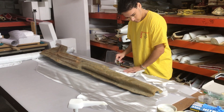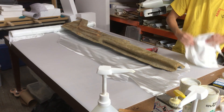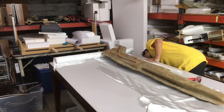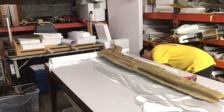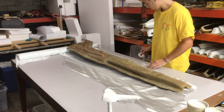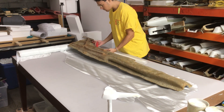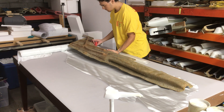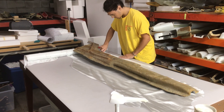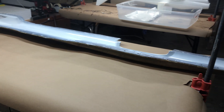The first thing we do every morning before we start doing layups is cut the cloth. We have this really cool Rhino cutting mat. We keep our cloth stored on rolls in a climate-controlled environment, then pull them out and lay them out on the table to do the cut. Simon is doing the cuts for this model using a roller cutter on the Rhino mat, which makes it really easy to do the cuts.